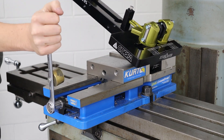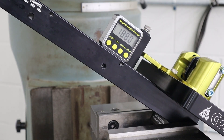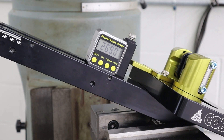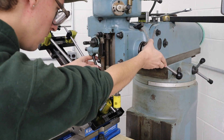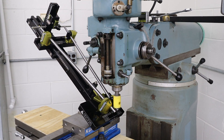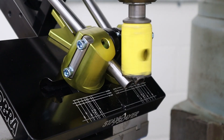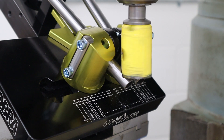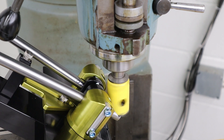Here's a demonstration of adjusting the seat stay mitering angle. You can use a digital angle gauge or a bevel protractor — those are the more common ways. I like using a digital angle gauge. Listen to the cut — when the hole saw engages it's a nice sounding cut; the tubes are supported well and there's no interference between the hole saw and the fixture posts because of the low-profile shape and contour of those posts. It's by intention.